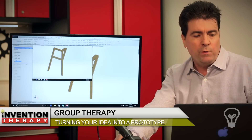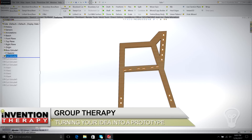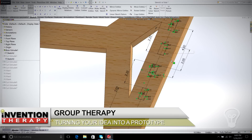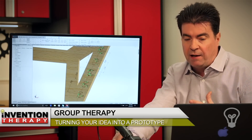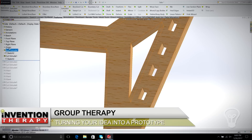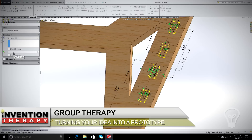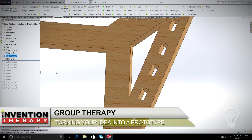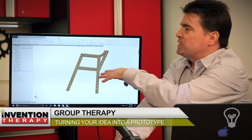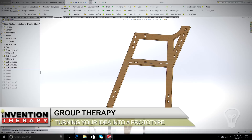There's our thickness, and then we just start adding features, done the same way — we did a sketch. I'm not going to go through all of this because I've already shown how SOLIDWORKS works, but this is a more complicated design than in my tutorial. You can see I've drawn a bunch of squares onto the wood, and then I told it I want to take these squares and cut them through. The way I did that is a command under feature called extruded cut, and I said go through all — so just cut it completely through. That gave me these squares, and now we have all the different slots in it.